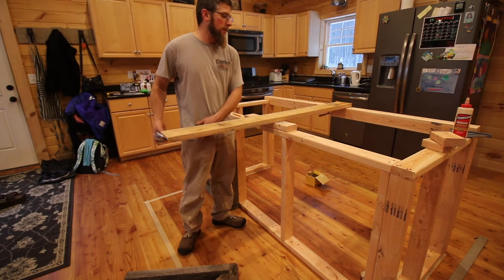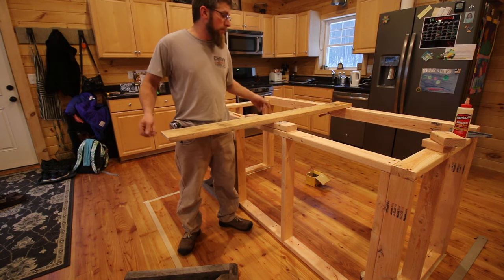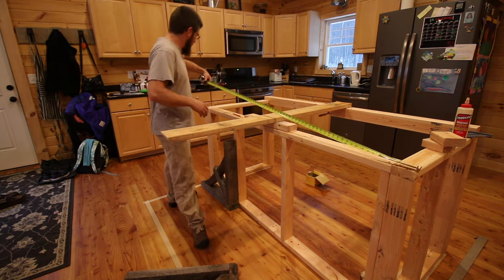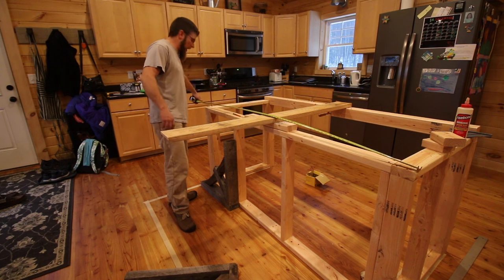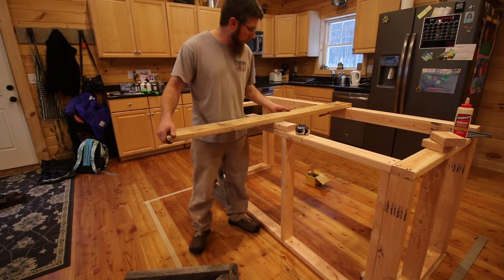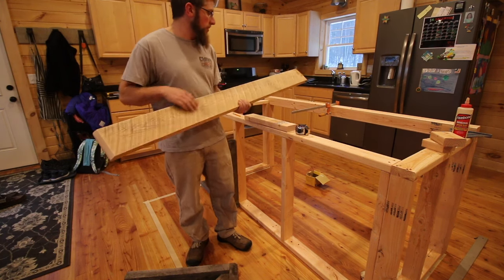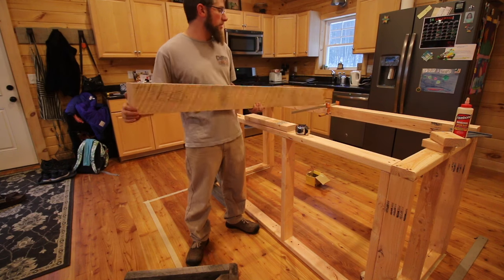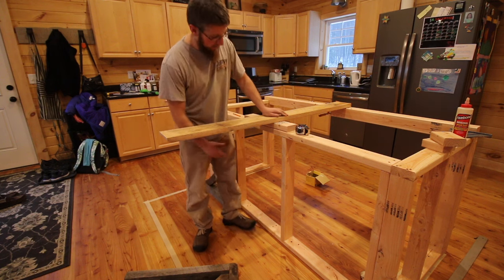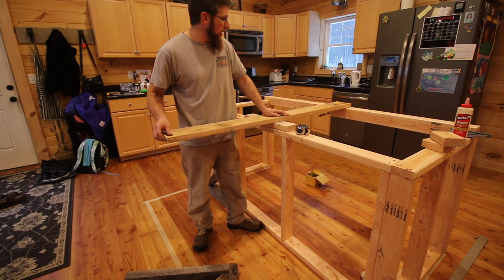The countertop has got to be at least six feet wide. I went ahead — six feet wide and six and a half feet long. I'm making a center support. I used this rough-cut quarter-sawn white oak, just sanded it down. It's inch and a quarter thick. It's oak so it'll be rugged. I'm going to run it across, recess it in the header, and if I have to I can put another corbel in the center. It's a small one that won't be in your way. White oak — it should be really rugged and sturdy.